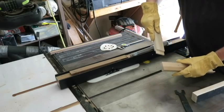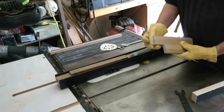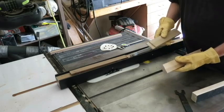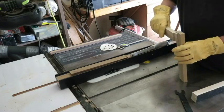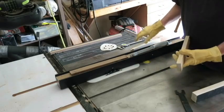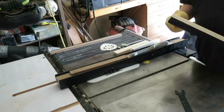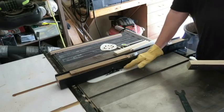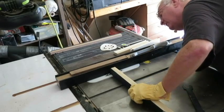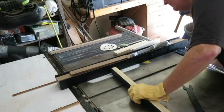The next piece of the drawer frames is going to be made up of pieces of poplar. The idea is I have a tenon on one end and I'm going to cut a groove in these and insert that in to make the frame. Originally I was going to make these tenons an inch long but I decided to go down to probably a quarter of an inch because I didn't want to groove as deeply into these boards. The mission now is to get this dado centered on this board — I'm going to make just a test cut and see if I have it a quarter of an inch from that edge.